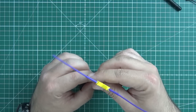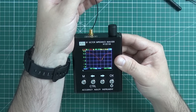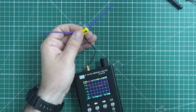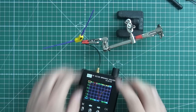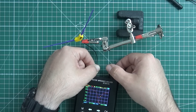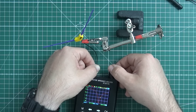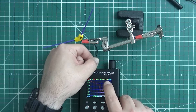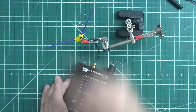Maybe not the worst tune ever. Let me connect this properly. That should be better. Taking into consideration that I just started plugging things in without measuring, the result is not that bad. It's only slightly too long, but at the frequency it's tuned to, the S11 is pretty decent — minus 18 dB.